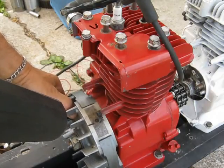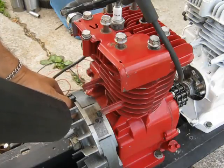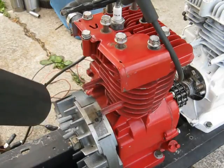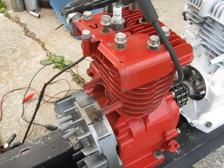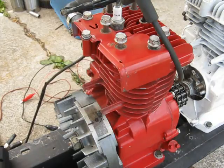That's about five degrees before top dead center. That's how I time the engine — knowing where the spark is firing. It's got centrifugal advance in this distributor, so it will be firing a bit earlier than that as the RPMs come up.